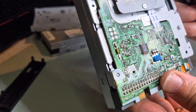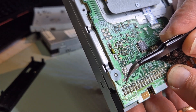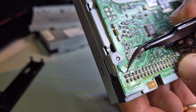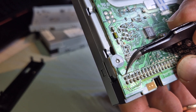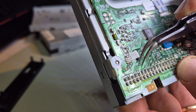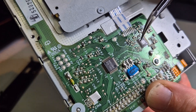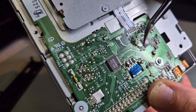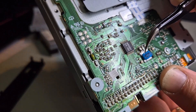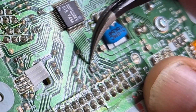Alright, this is our PCB exposed. So we need to do a number of things. First, we need to cut this trace here at pin 34. Cut the trace that comes out of it and connect pin 34 to this guy here. There's a number of little connectors — there's four of them. Connect that to the third here. There's a little component here which is actually a jumper.